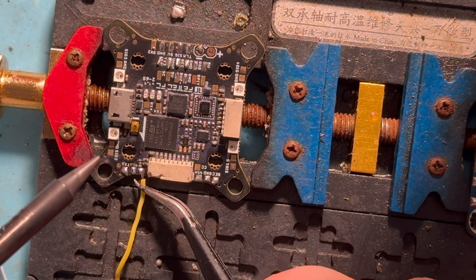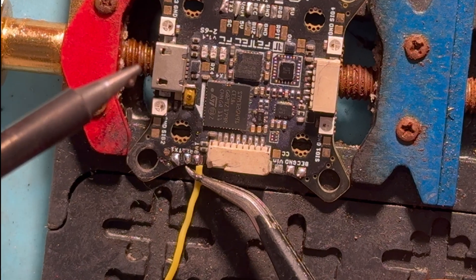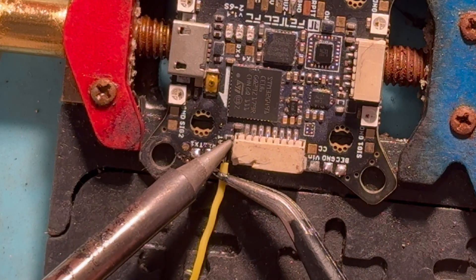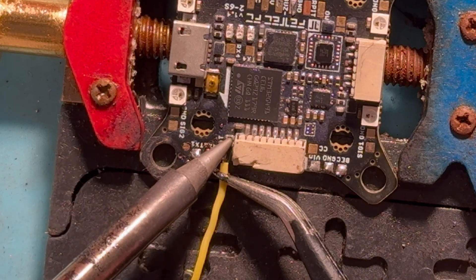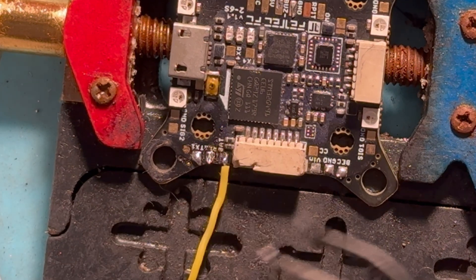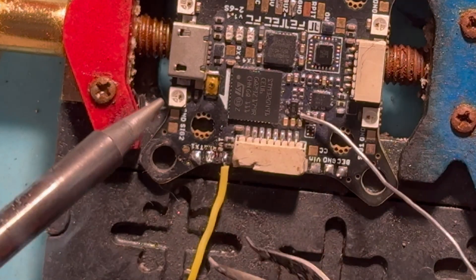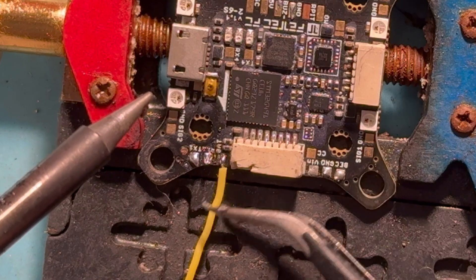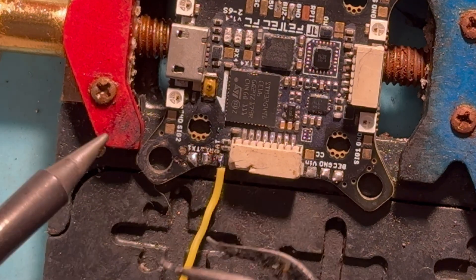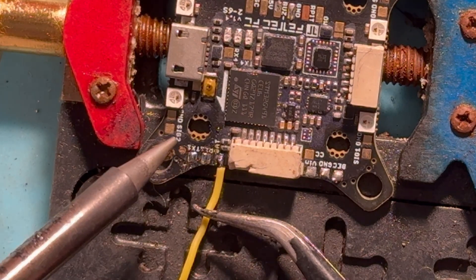Let's say we want to set it up on the hardest pad, which is the closest one to the connector. Put it above the solder joint, have a little solder on the tip of the iron, and then just touch it to it — you're trying to touch the wet part to the top of the wire and melt it into place. If you're not happy with that, just come back and hold it again and touch it. If you're concerned about bridging the pads you can just run the iron down the middle and clean everything up.